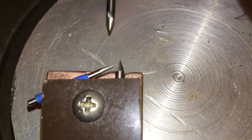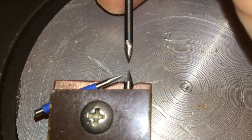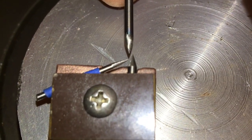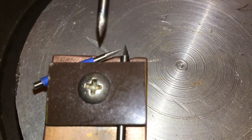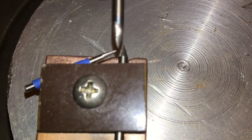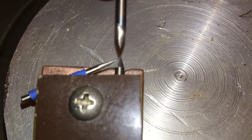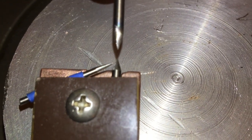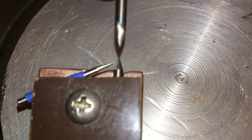I didn't know much about these. Its purpose is to help get a more stable, repeatable spark. When you have sharp electrodes and you don't have the teaser, the voltage builds up between the two electrodes, but the point where it actually ionizes the air can be quite random. With the teaser — although it's insulated from the copper and not connected to anything — it seems to act as a little reservoir of electrons. Because it's very close to the main electrode (in this case seven thou), a tiny spark will form there, ionize some gas, and make the main spark form at a much more consistent voltage. That's my understanding.